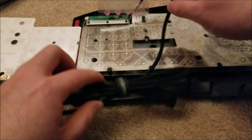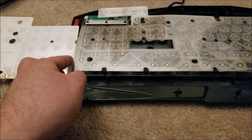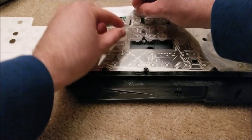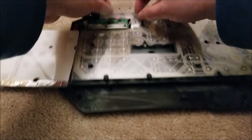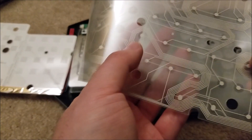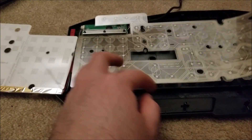So while we're at it, I'm just going to unpower that for a second. You can see the membrane keys. The way that they're doing this is just a flat flex — a giant flat flex membrane that all the keys are going into. It's pretty interesting; there are basically three layers: a separator with little holes, the rear which is the center point in the back, and then the front has more patterns. You can see there are little circles which are all conductive traces. When I press between the front and the back, the two dots line up, and when pressed it actually connects the two halves.